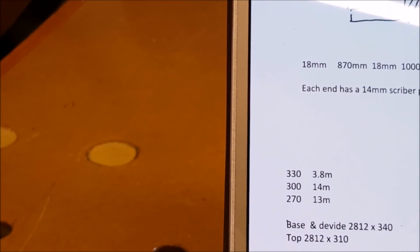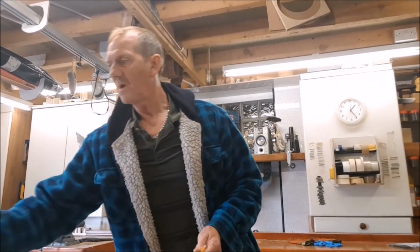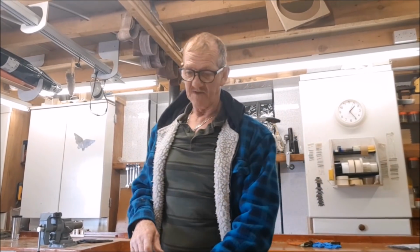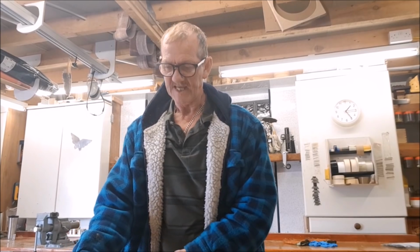Now remembering that these boards, first thing we need to do is minus the size of the pieces that are going to go in. The timber that I've got that I'm going to use on a capping is officially 70mm, but it's actually 68mm. But I don't want to have any waste, I don't have to cut down the length on every one of these. So I'm going to use the whole 68mm and calculate that.